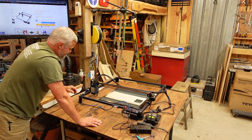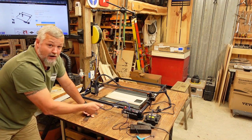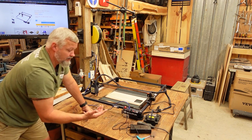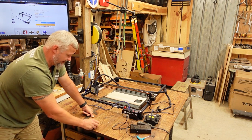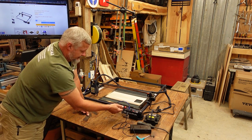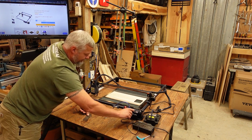As long as you stay away from it — if you have an enclosure where you're not leaning across that area, that'd be great. The key for the main controller is nice: you can put it in the on position and get rid of the key if you don't need it, or turn the machine off and lock it out and take the key with you. It has a rocker switch for power rather than a push button you hold for several seconds — a lot less confusing. You do have the USB cable sticking up, and they give you a right-angle connector for power, so you may want to get a right-angle USB as well.